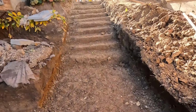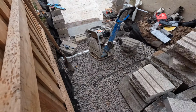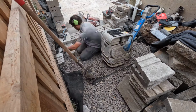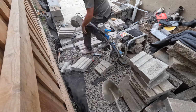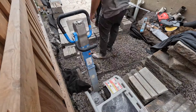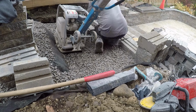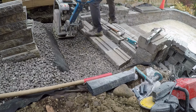So we do have this area, which will actually be a small landing. It will be step, step, step, step, a 2 or 4 foot landing, and then step, step, a 2 foot landing, step, step, a 2 foot landing. And that's how we're going to make up our additional 8 feet. That's just how we go about calculating this and using our U level to get elevations to make sure we are deep enough. We went way deeper here.